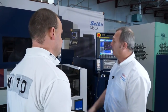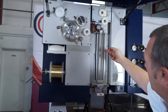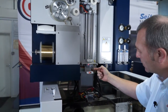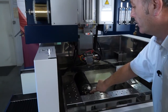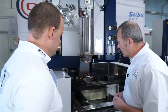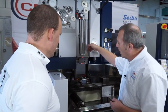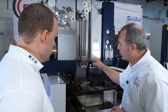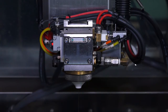An integral part of the machine is the automatic wire threader — can we have a look at how that works? The wire is fed from this spool here, through the pulleys, down through this tube, past the sensor here that detects whether the wire is present, straight through the power contact at the top to the power contact at the bottom, and that's ready to go. When there's a breakage on the wire you're notified straight away. The system will notice straight away and the sensor will detect whether there's a breakage in this area. It can wind the wire back up, sense where it is and re-feed it through. There's a small robot arm that comes out and grabs the part and takes away the little bit of wire that's no longer used.